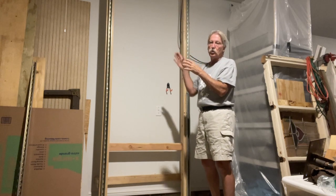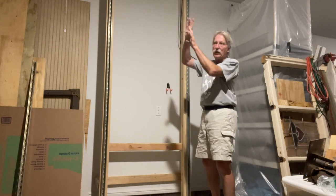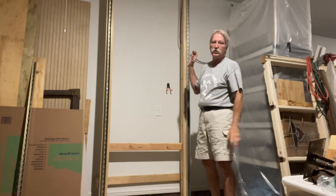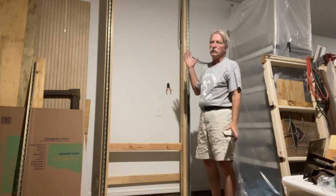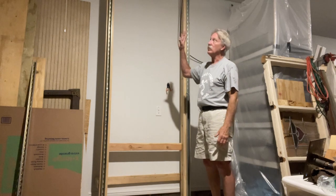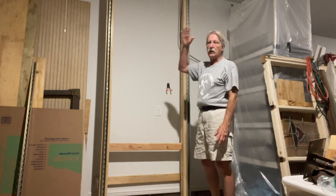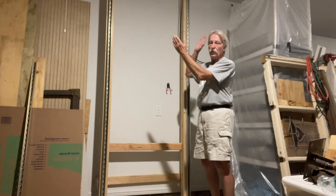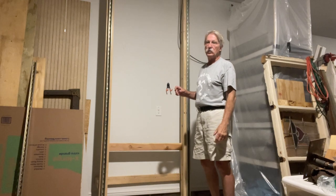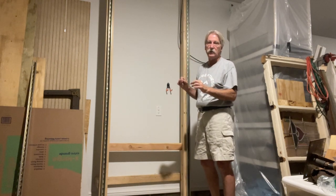Since standard spacing isn't wide enough, you're going to have to cut out one of your ceiling joists and put headers on both ends to support the two loose ends of the joist you just cut. I'll show a drawing about that in just a few minutes — a hand-drawn animation — so you'll understand what it looks like.